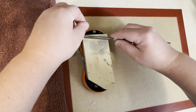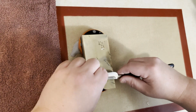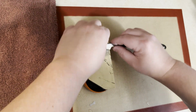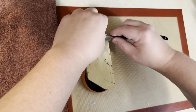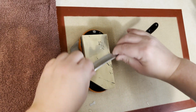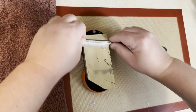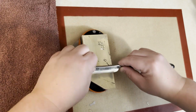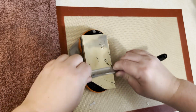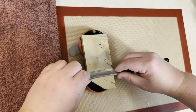I guess I'm not going to use the slurry stones. I just really want to feel what this edge feels like from the slurry from this stone itself. So I'll just keep honing off of the slurry that I made with the diamond plate. Lessened up the pressure some more. Now it's a little less than medium pressure. It's already wanting to grab on one of the sides.